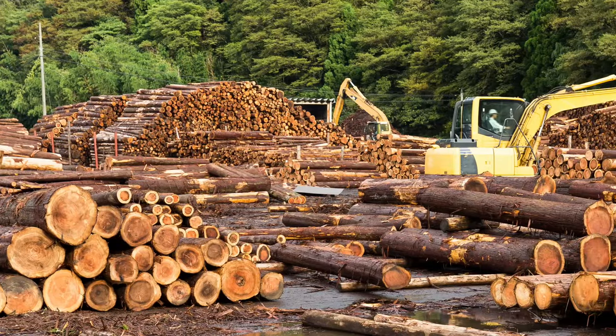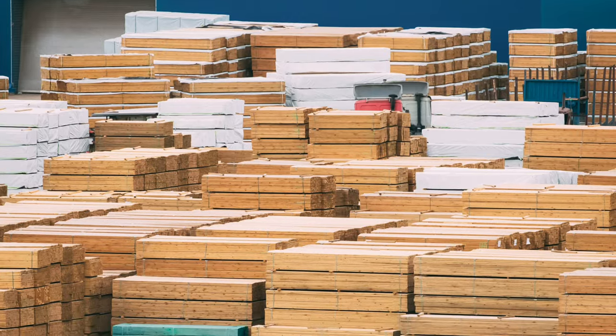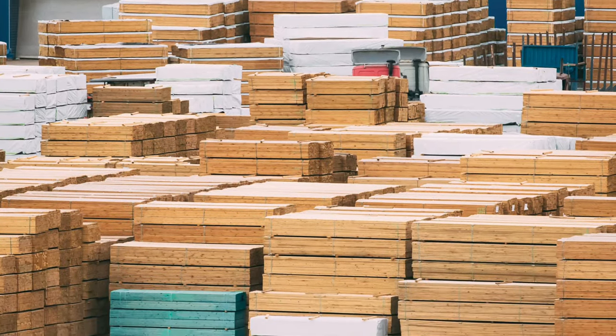All of the wood that you would frame a house with — 2x4s, 2x10s, 2x12s — it's all kiln dried down to a maximum of 19% moisture content. I think that's in the codebook somewhere. So that's good because it's relatively dry. It's going to dry a little bit more, probably, depending on the climate you live in. So that's a good kind of neutral position that works for any area.